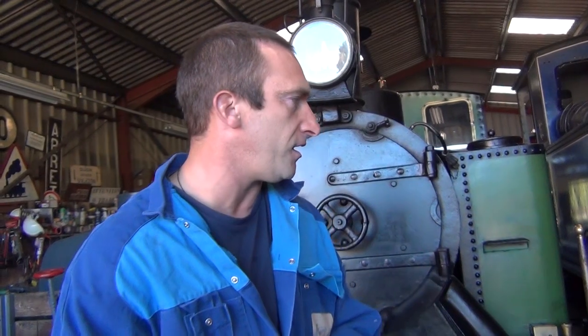The first verification is: we are going to verify that there is no water on the footplate, which is a very serious anomaly. Then we go to the cabin to verify that we have water in the boiler and that the hand brake is well applied, which proves it is functional and there is no anomaly. I invite you to follow me into the cabin.